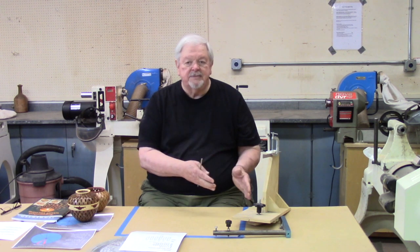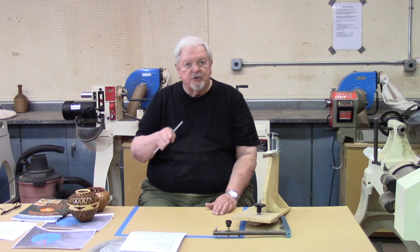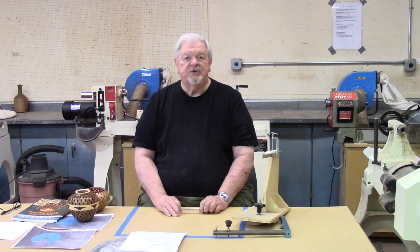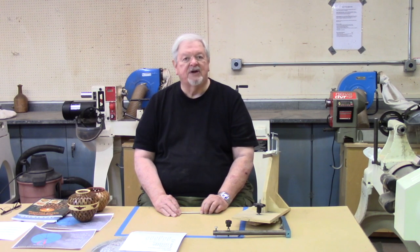So sanding, installing, and deglueing is a process that's repeated for every single segment. I timed it, and you probably can too. If you watch that video, you can go back and play that part over again. You'll see that's almost 45 to 50 seconds per segment. And that means to go 24 segments around, you can figure there's half an hour's worth of work in putting each ring in.